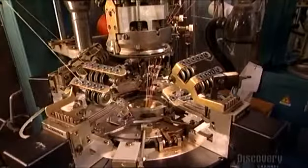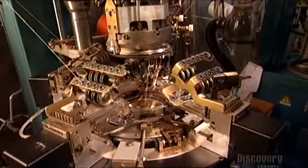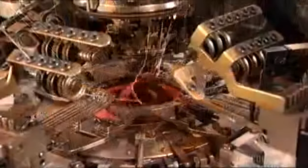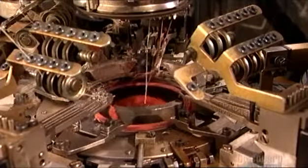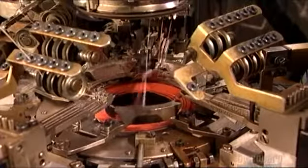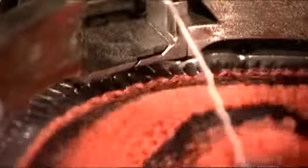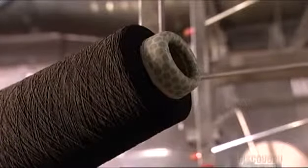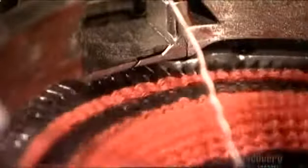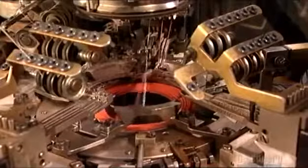Here's a machine with the top open so we can get a view of the knitting action. An automated whirling cylinder pulls yarn from spools through holes in metal spokes. Little hooks on the needles grab the yarn — the hooks have latches that open as the hooks snare the yarn and close as they knit so you don't lose a stitch. This machine knits socks a lot faster than grandma, sometimes making over 360 pairs a day.